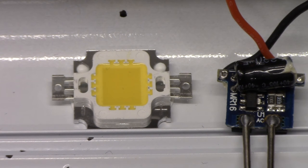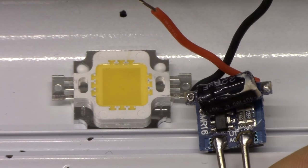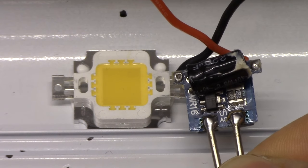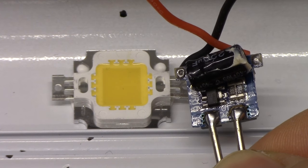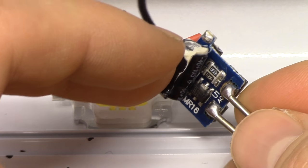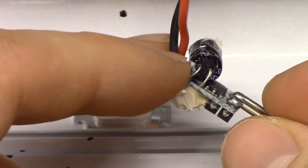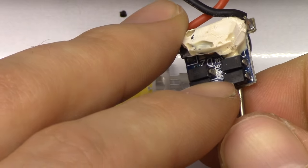The drivers are really interesting little devices. They're built around this tiny chip you can see in the lower left part of the board, which is a Chiplink CL6807 LED driver — a tiny little switch-mode device specified for an efficiency up to 95%. It basically just requires an inductor, a capacitor, a sense resistor, and a diode, and you're good to go. So the switching diode is there, the inductor is hiding underneath that gunk, the input cap is right here, and we also have a bridge rectifier circuit sitting there.